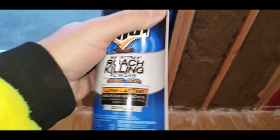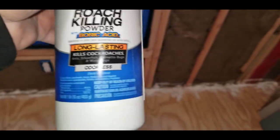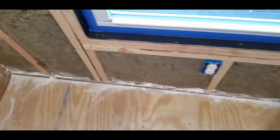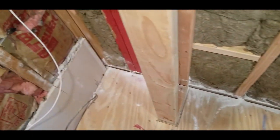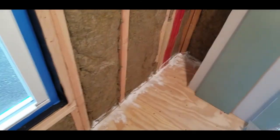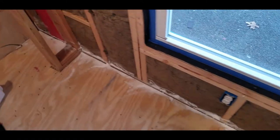I put this ant and roach powder. Different people make it. Boric acid is what you're looking for here. Not a sponsor. I like to put it on the sill before I close the wall up. So if any bugs should infiltrate, they will immediately walk through poison, which will stick to their legs and wipe out them and their colonies. So I will bring death to you and your entire family if you trespass on construction I built and you're a bug. So just a little tip there. Throw a little bit of bug powder down before you start building.